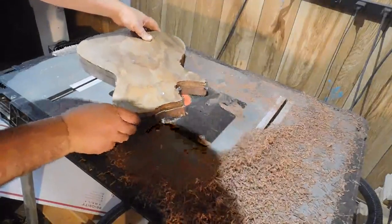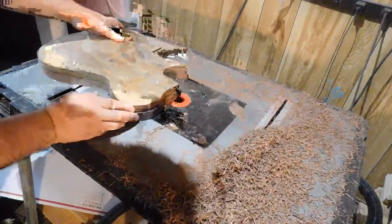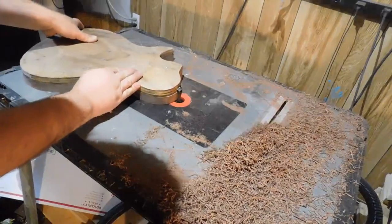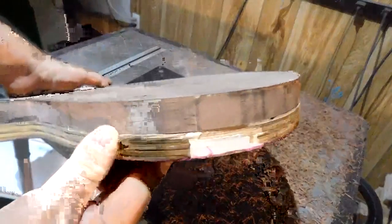But when it's in handheld mode, the bearing is on the bottom — so it's called a bottom router bit. And there it is. I've shown you how clean it came out with just a single pass. If you get real close to that edge when you're cutting it on the bandsaw, you can do that without too many problems.